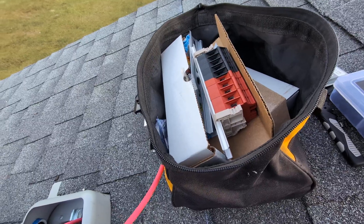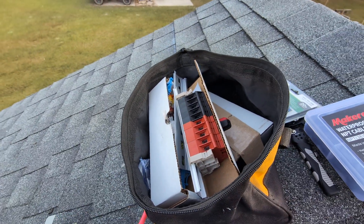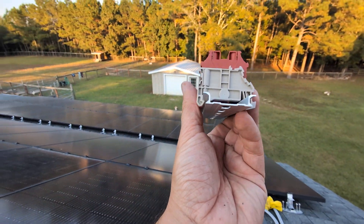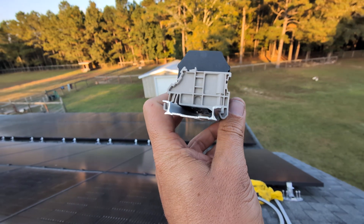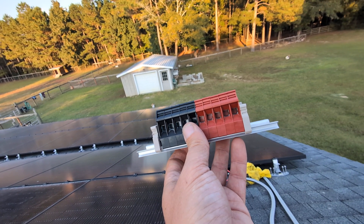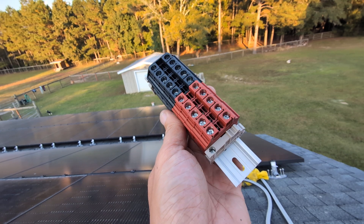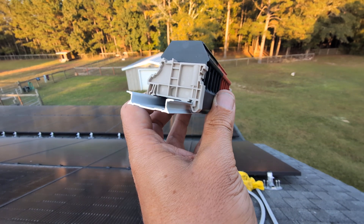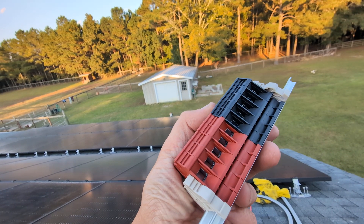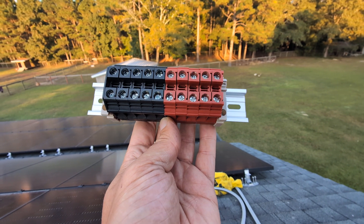For larger gauge wires — eight gauge and above — you'll have to go with something that has a much bigger grip plate. Also look at the ampacity: the ability for the connector to carry amps. This is a very low-amp, high-volt system — I believe it's running around 320 volts at about 15 amps per string open circuit. These aren't terribly high amps but are really high voltage, so make sure your voltage and amperage are both handled by whatever DIN connector you're using. These make wire management a lot easier, and I'd highly recommend keeping your system well organized and labeled.